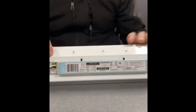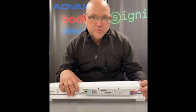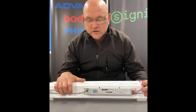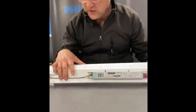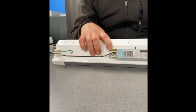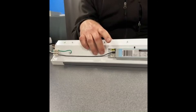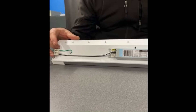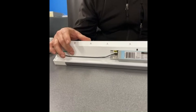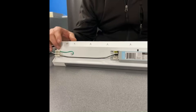The actual implementation for wiring is very simple. On the input, we have a neutral and a line wire — neutral and hot — and those connections are made there. The driver case itself is grounded, so the grounding can be done here with the case to the luminaire itself. Close to the input junction, you put the grounding screw into the luminaire at that point.